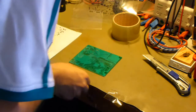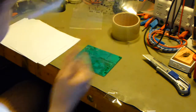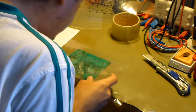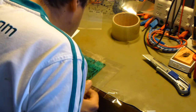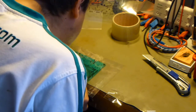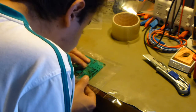First side I already exposed, now the second side. I do it a little bit like this. Single-sided, but also double-layered film. Now, I just fit the film onto the PCB, so the parts that later shall be free of the resist are nicely covered. This isn't too hard. We're not talking about a micrometer here and there.